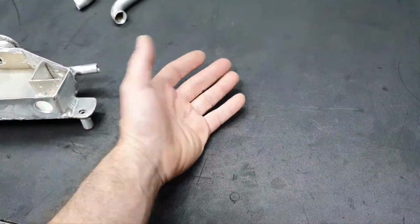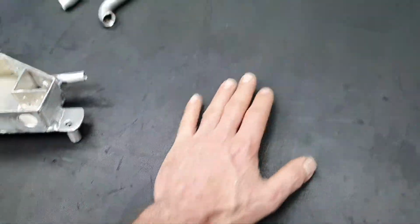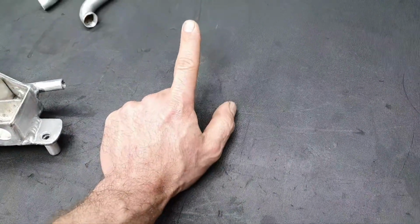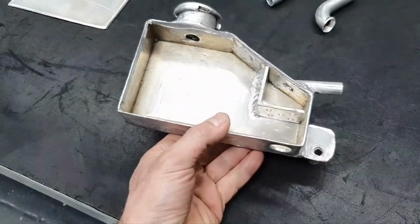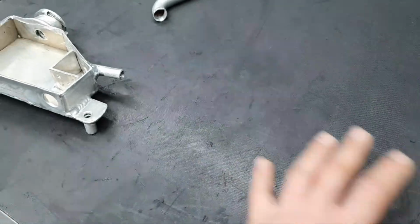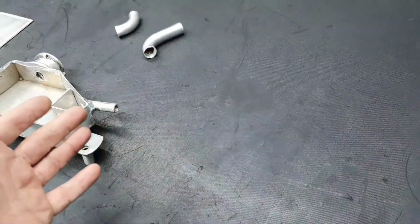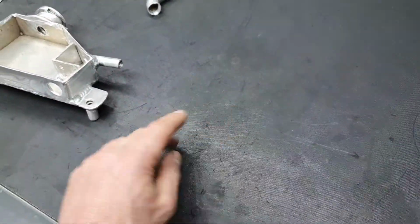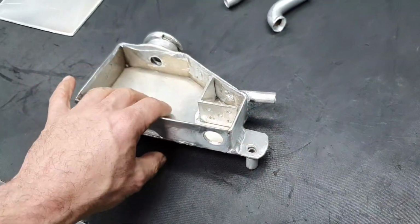The hydraulic pump is pushing between 50 and 70 liters per minute. Let us say 60 liters per minute, all right? One liter per second. Fine. If, let us say, the hydraulic system has 2 liters in total, for example, with the cooler, the tank, the pump, and the steering rack, let us say it has 2 liters. I doubt it even has 2 liters, but anyhow, let us say 2 liters. That means it needs 2 seconds to make one cycle of the fluid.